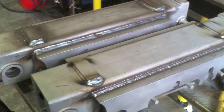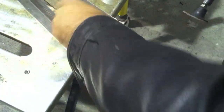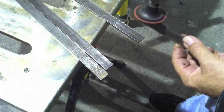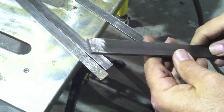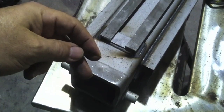But this week we're talking about TIG welding some bar stock to the top. Once the plates are all welded on, the next thing to do is weld these quarter-inch pieces of bar stock to the top for some of the hardware bolts on. TIG welding just kind of does a nicer job. I've MIGged them and TIGged them both and they both work out just fine, but today I'm TIG welding.